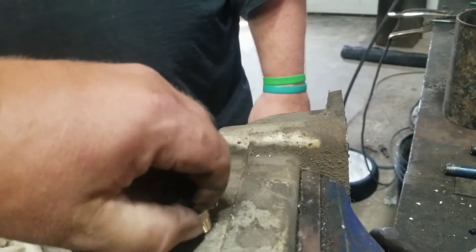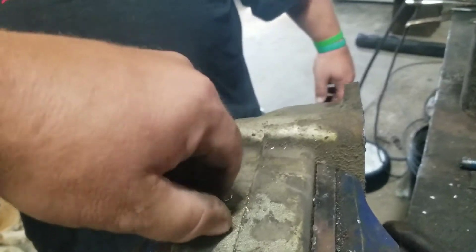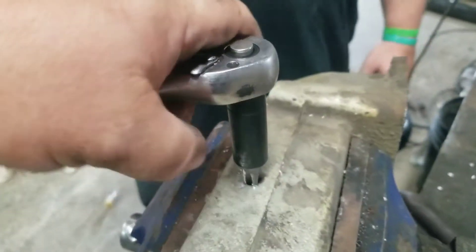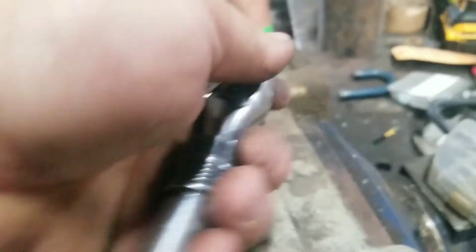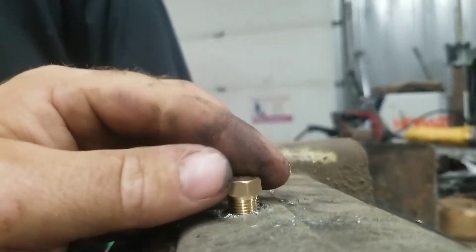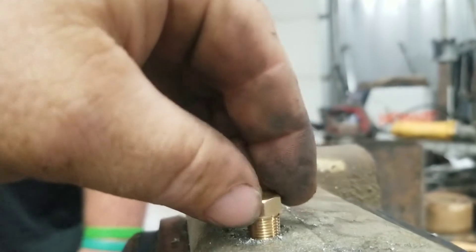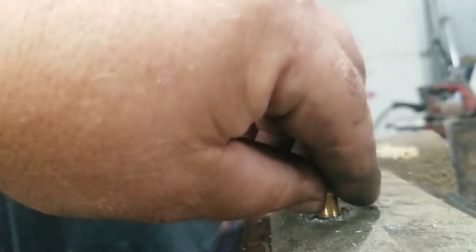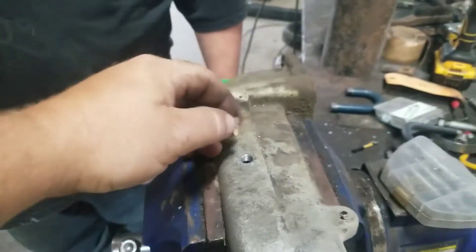Probably better go a little deeper with our threads — that's not going to sit in there real well. A pipe thread is a tapered thread, so essentially when you go a little deeper you're making the hole tapered wider all the way through. That's going to make the hole seem a little bigger around and the plug will thread in farther, not just on the tip or the outer edge. You want to make sure you get good thread contact. You can see we got quite a bit more thread in there now — that'll be deep enough. When we tighten it up and leave it in there it would go in about like that, and we can assess that later if we want a little deeper.